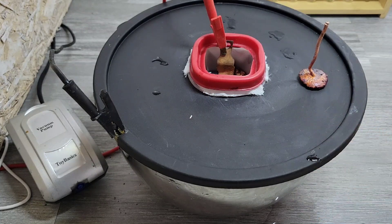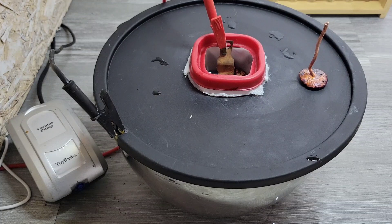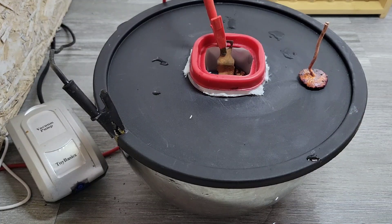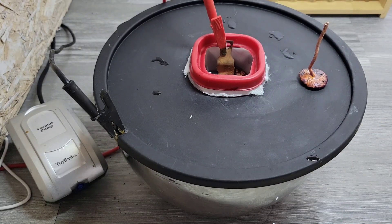I'll keep you posted on this — that's going to be the video for now, short and sweet. I have some capacitors that I incinerated and they're now in the mill, so I'll be working on that tomorrow. I'll do a gravity separation and then throw them in a nitric bath so we can get some silver out of those — so that's coming this weekend.